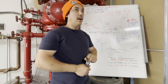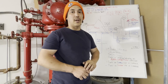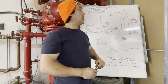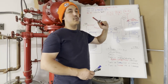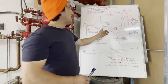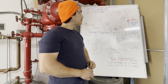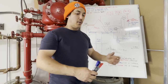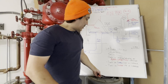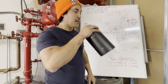Pros and cons to both: the con to a manual system is I need to actually keep an eye on my pressures — do daily and weekly checks, make sure my gauges are okay. I need to know at what pressure my low pressure supervisory switch goes off, so I know when pressures are getting too low. I will need to manually come and open up these two valves, turn my switch on, and pump it up. And of course, knowing everyone's luck, that low pressure switch is going to go off at 2 AM — someone's going to have to show up in the middle of the night and pump the system up.